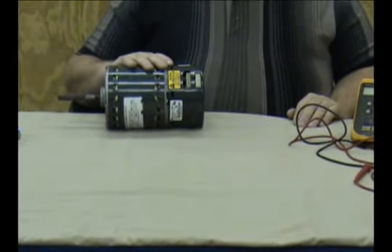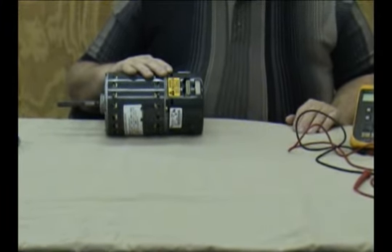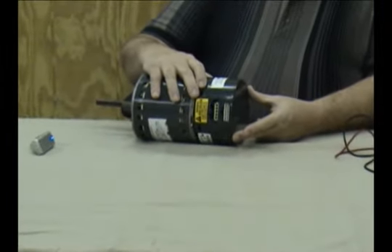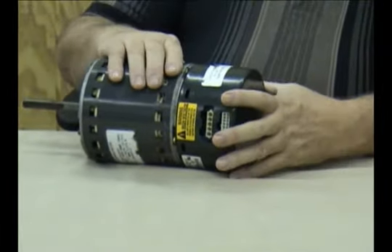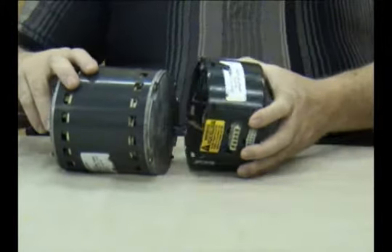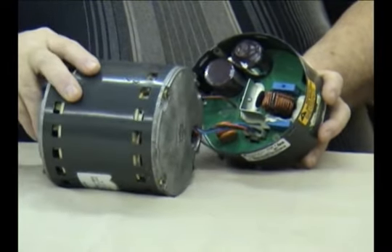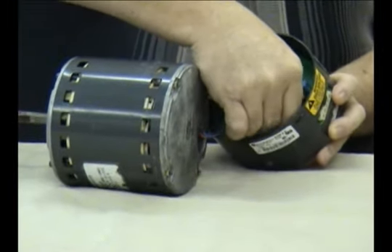I'm not going to sit here for five minutes, but you have to wait those five minutes or your customer might wake you up from the floor with a bucket of cold water. After you've waited the five minutes, there are usually two to four bolts that need to be removed to separate the two halves of the motor. The module section either easily pulls away or you might gently pry it off. Once that section is separate, there's a three-pin connector in almost all these motors that needs to be disconnected to allow you to do some tests.